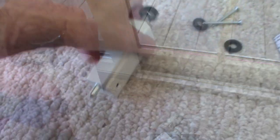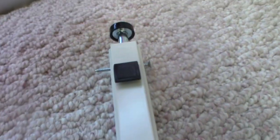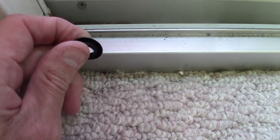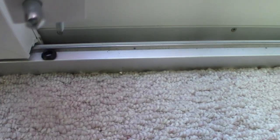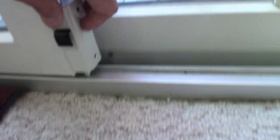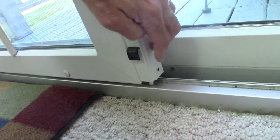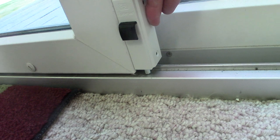Here are the actual parts. The two screws go in here — one screw here and one there. These little grommets, once you drill the hole, go in to cover any rough edges. The stopper piece for the bottom of the lock goes inside there. Let's do a dry fit and see where we're at — you can see it's made for this door; it sits in there beautifully. When you step it down, that's where it's going to go. The tricky part is just marking where you want it.